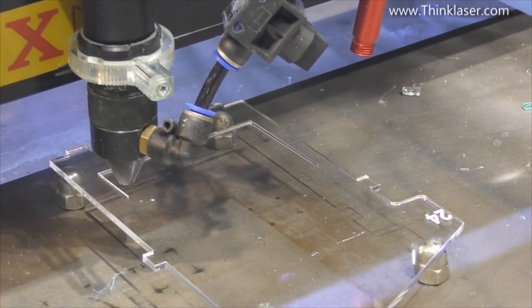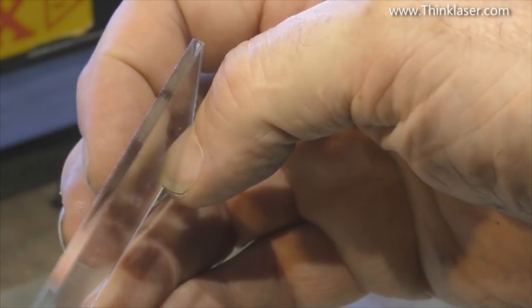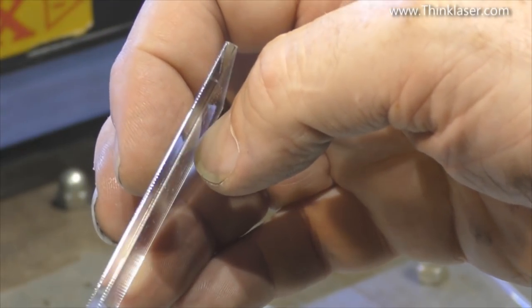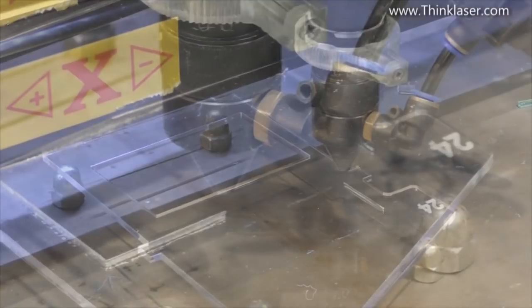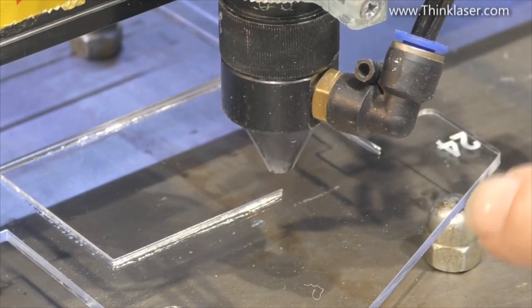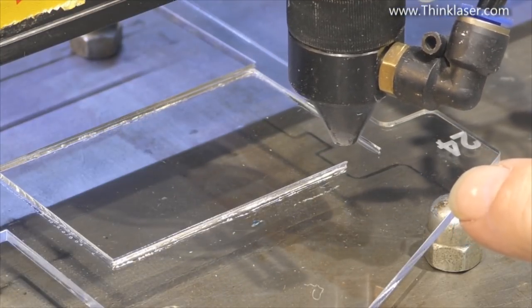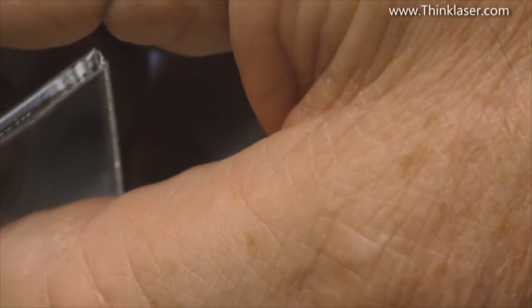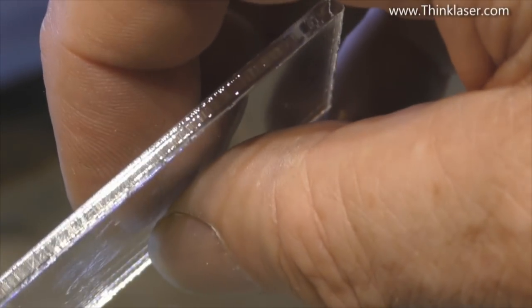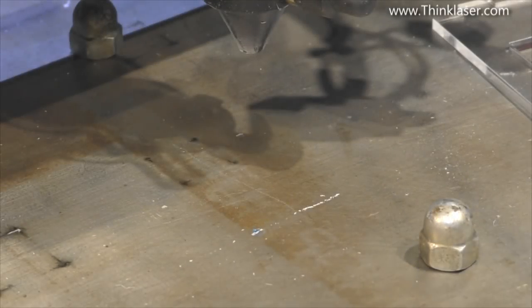Sadly, the edges of cast acrylic are clean but full of striations - fairly fine striations. As a general rule whenever I do engraving I leave the plastic covering on. We're now running at 2mm per second for 8mm thick material. If I want a polished finish I'm going to have to go this slow. You'll never get a high shine on extruded acrylic, but it's actually quite a nice clean finish free of striations - which is the important thing.